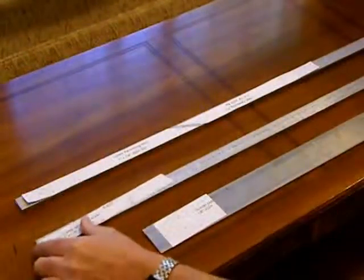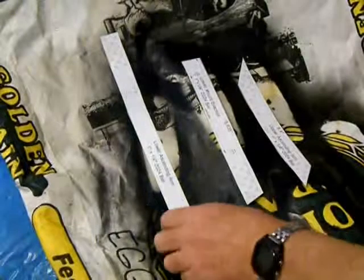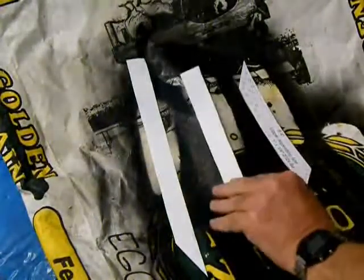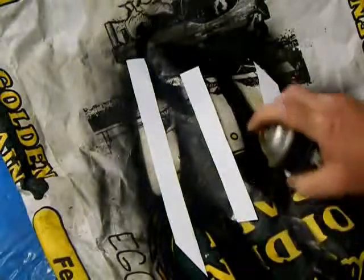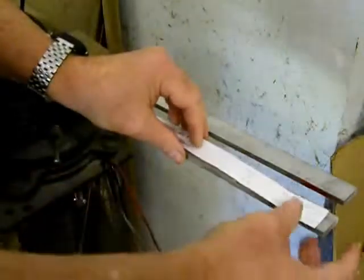Next, cut out the lower mount bracket, lower ascending arm, and upper ascending arm. These cutouts will be used as patterns to make the parts. I'm going to use spray glue to stick the cutouts to the metal, but plain Scotch tape works too. Notice how I take advantage of the factory square ends.